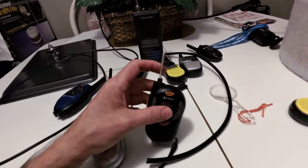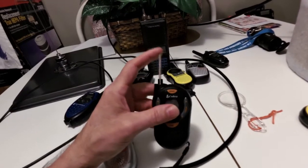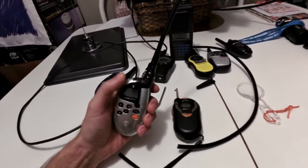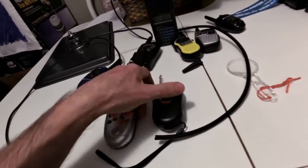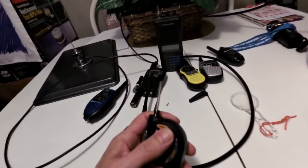What I've done here is devised a way to use the built-in antenna that it came with and simply make it more efficient. What we're going to do is convert this into a real quarter wave — and when we're done it's going to look like this. Simply take your hand or some pliers and grab this coil and extend it all the way so there's no kinks in it.